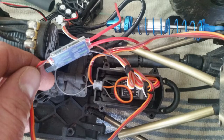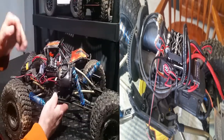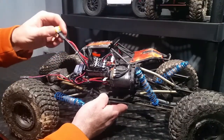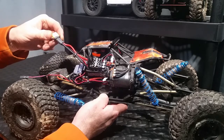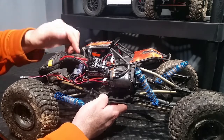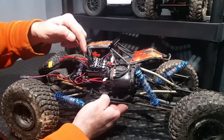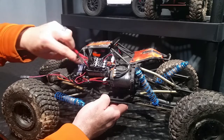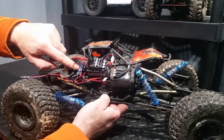Lastly, you just go ahead and plug that into your unused receiver port, as long as you have a corresponding button on your remote for it. And then you just tie up your wiring a little bit. So I ended up having to run my power directly up to the back of my XT60 connector, ran it down, heat shrunk everything. And then from there, the hot side is wired directly into one leg of this Turnigy switch, just like I had mentioned.